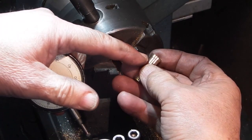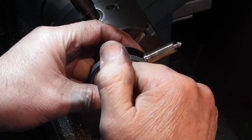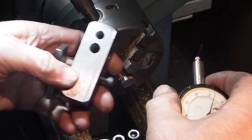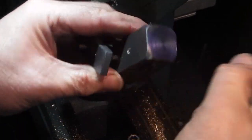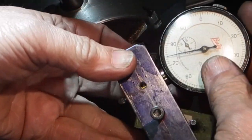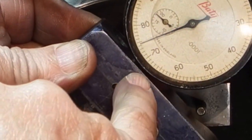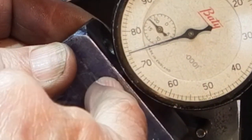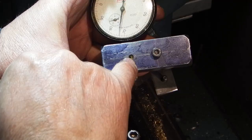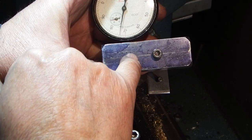We've made this brass bush with a head on the end. The idea is that will go on there and be level with the top of the dial indicator. The brass bush will fit into there so that when it's fully home you've still got a gap between the dial indicator and the block, and you've still got movement on the dial indicator from that side. The next job is to tap a hole in the block to take a locking screw.